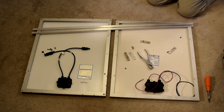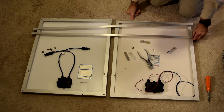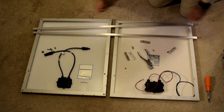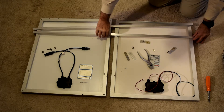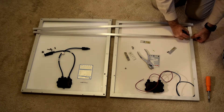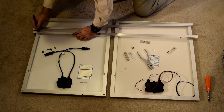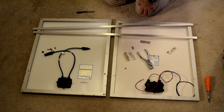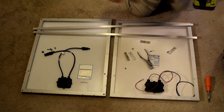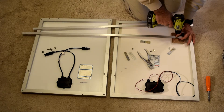What I'm going to do now is lay out my new strips here and see what I can do in terms of getting everything lined up to drill some holes in the aluminum flat bar. I'm going to mark these for drilling. And so at this point the next step will be to get my drill set up and drill this — for this size screw the clearance hole is 5/32 of an inch. I'm going to drill these over the actual solar panels because my wife would not appreciate aluminum shavings on the carpet here.